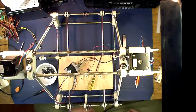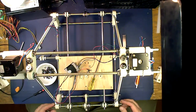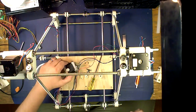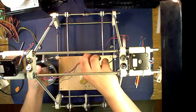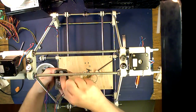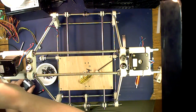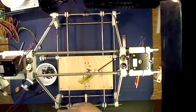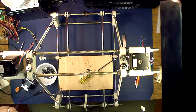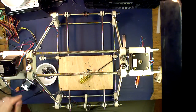I'm doing the next section of my Y-stage installation into the Prusa Mendel. For this one, you're going to need your Y-stage motor, NEMA 17, 75 ounce at least. If you can swing it, get one that already has your wires hooked up and long leads. If not, you'll have to create your own long leads and your own clip.